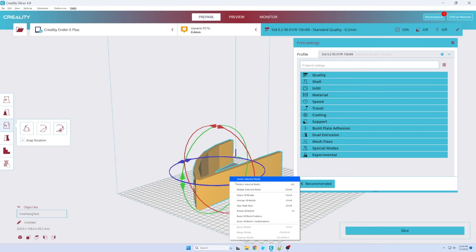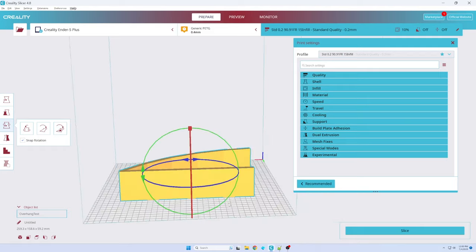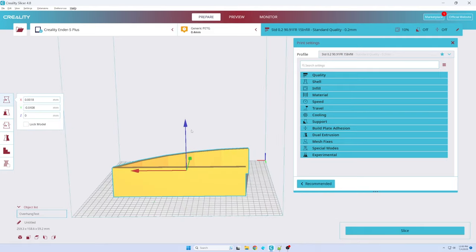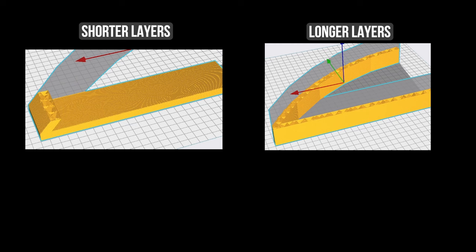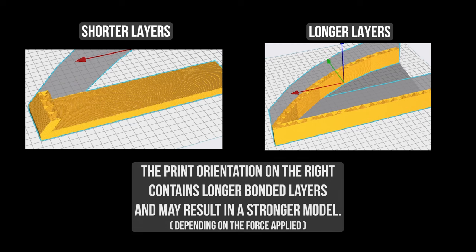The other option is to simply adjust the print orientation. No more overhang and no wasted time or filament. You'll get better at understanding print orientation and slicer profile settings as you print more objects. Print orientation can also be important as it comes to the final strength of a printed object. Remember, when printing layers, layers adhere to other layers, and depending on the stresses your object can be expected to experience, printing in one orientation versus another can actually make the object stronger.